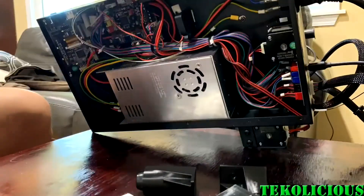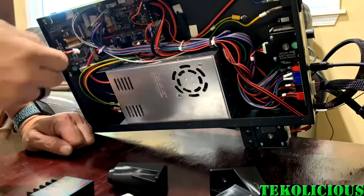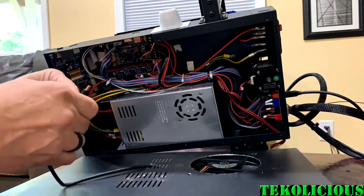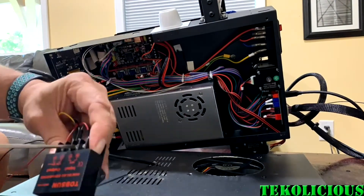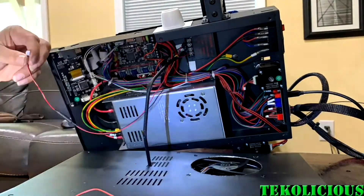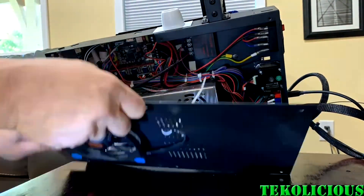I'm going to show you what I did originally, because you need to learn from my mistakes. I assumed that the motherboard fan power would have some kind of a diode in it to protect from any kind of back feed, and have the amperage to run more than just those tiny fans that come with it. I was wrong on both points. In premise, what I did should have worked if it wasn't for the fact that these Chinese boards are extremely low-powered and underpowered. I know that newer boards actually have multiple power outputs now — they do 12 and 24 volts — for just this reason.